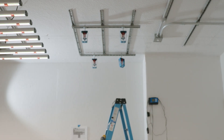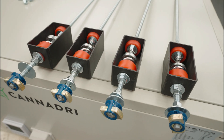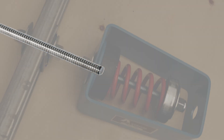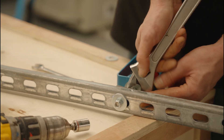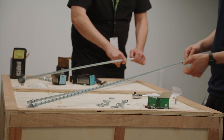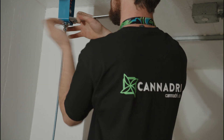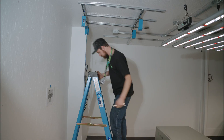Now with the cage built, it's recommended to add vibration dampeners, which will ensure the unit is running as quiet as possible. We do this by cutting an 8-inch piece of 3/8 threaded ready rod, and then bolt the vibration dampener to the unistrut using washers and lock nuts. Then add a second piece of ready rod. This ready rod will need to be at least as tall as your unit, but you may want this piece longer so your unit hangs lower — this will all depend on your ceiling height.